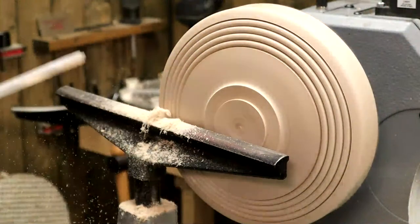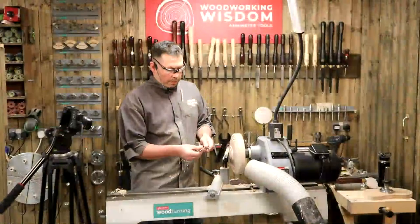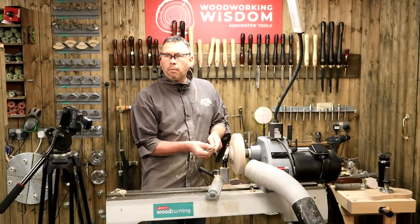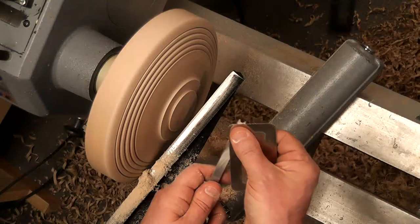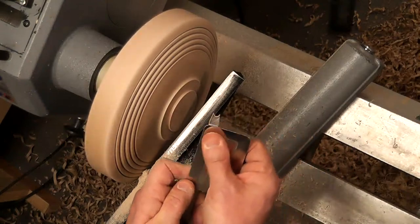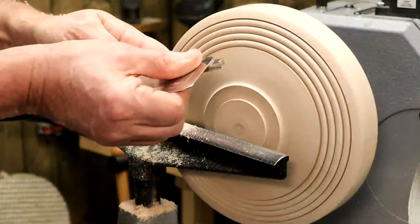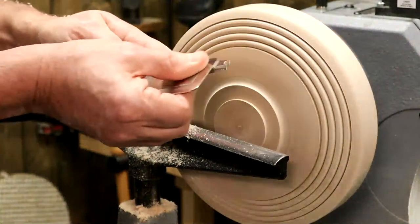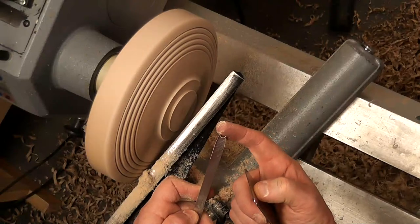And to sharpen these, as I know we're going to get that question in a minute, pop the diamond card on the top and sharpen the top edge. Don't mess around with that front profile. Really important on this, that profile shouldn't change. So we've got to sharpen the top edge, not anything around here at all.